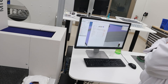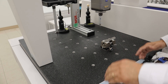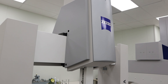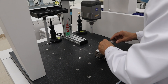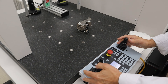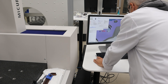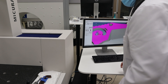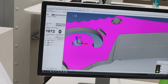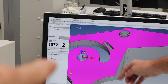This specific machine was just calibrated using the highest accuracy protocol for Zeiss machines — the Xenos protocol — and is calibrated to 0.3 microns. We'll run each blade through and then compare the data, analyze all the results, and look at dimensions like position of each feature — the endpoints of the arc, the detent arc, the pivot hole, and the lock face. Everything and how it all relates to each other.